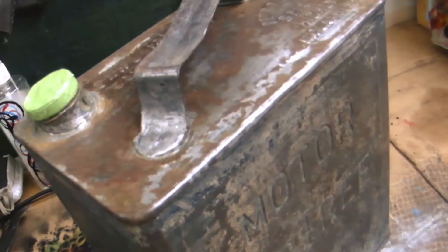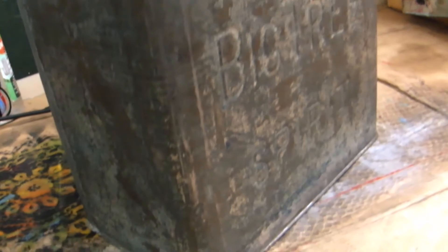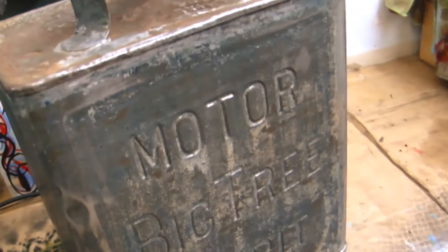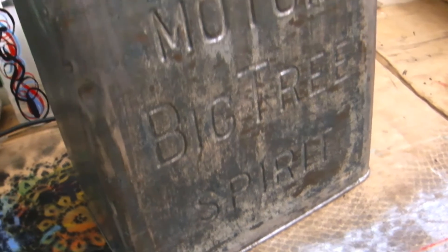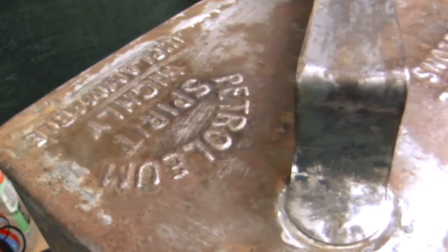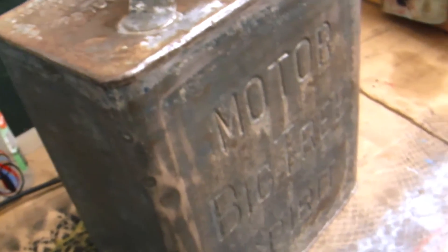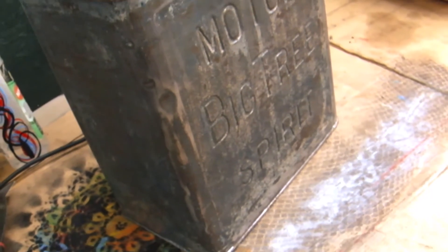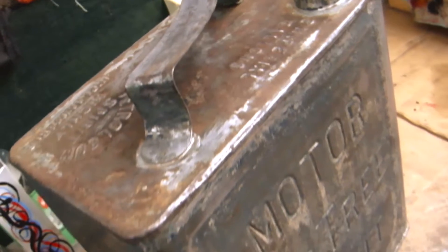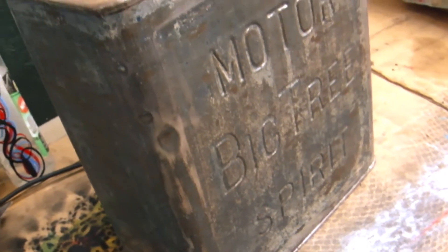Here's how we look — all cleaned and tidied up. I've picked the paint out of the letters, wiped it over with some isopropyl alcohol, cleaned it up, and now I'm about to put some rust neutraliser over it and hang it up. It's a three-step process: I put the rust treatment on, let it soak, then wipe it off with methylated spirits, wipe the methylated spirits off with water, and dry it off. I have isopropyl alcohol, so that's what I'll be using. Now I'm going to get to it — say goodbye to the rust.